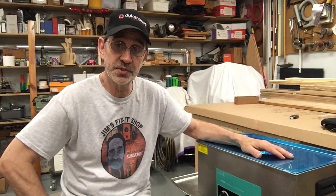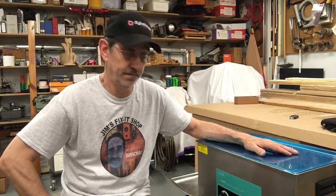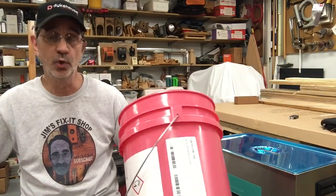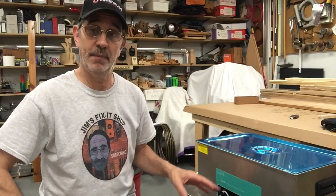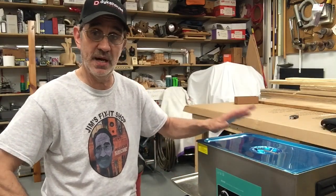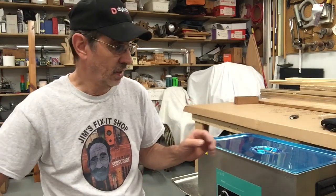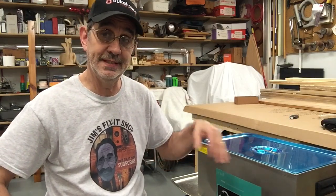I'll keep you updated on how I like it. I use Simple Green and water in it. When it starts to get dirty I have a five-gallon bucket — just an old coolant bucket from work — and I'll drain the tank into that through a filter. When I get all the stuff out I wipe the inside because the bottom is just full of crud, then I pour it back in through another filter so it cleans up really nice. At the cost of a gallon of Simple Green, I don't think I want to fill this and then dump it every time I use it.